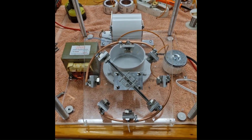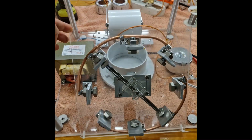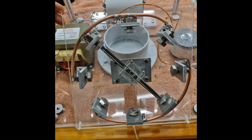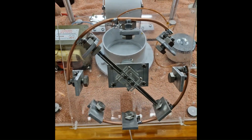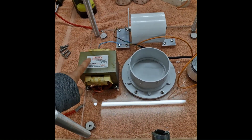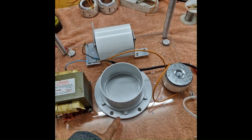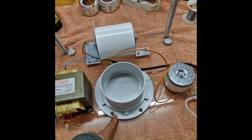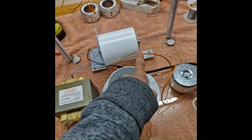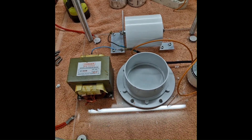Here we have some of the parts assembled - our tungsten rotary spark gap. Some of you would have seen me present this in another video on how to fabricate one of these. All the other components of the single microwave transformer Tesla coil are very simple: a single microwave transformer, big capacitor as we talked about, and the secondary coil stand fixed to the base plate, and a current limiting inductor that will current-limit the transformer so that it doesn't overheat.